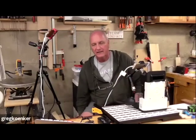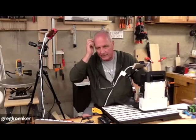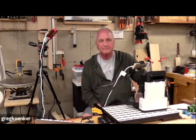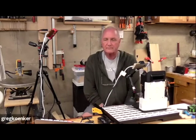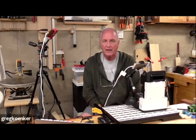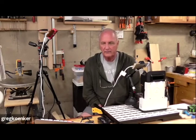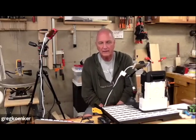And I think the big trick for one of those kinds of projects is when you start doing it, you don't stop. When the slab is there, the legs are ready, you start cutting it, and you do it the same day. Yeah. You do it as fast as you can, because once you start cutting into it, it starts moving, and joints start opening up or closing up.